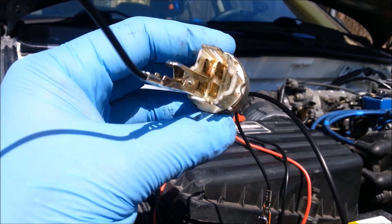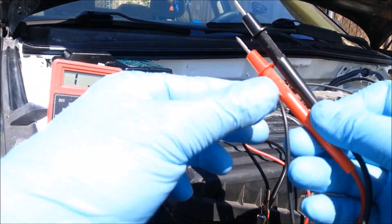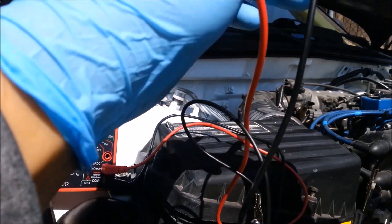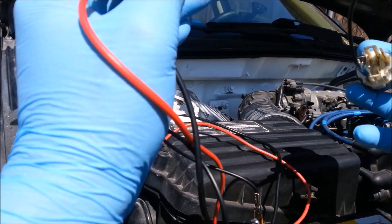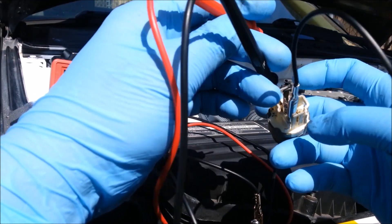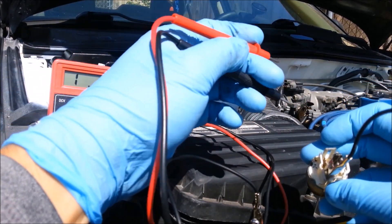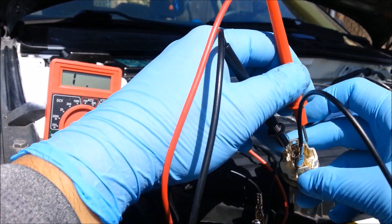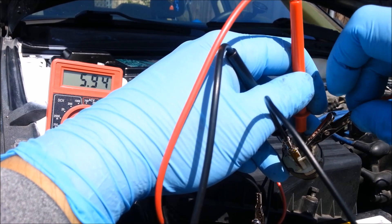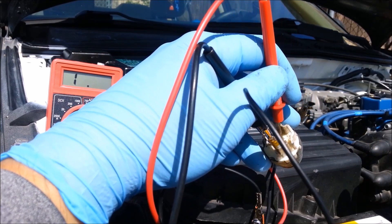It's working, but sometimes a click is not enough. Take your voltmeter, set it to ohms - make sure you have no resistance, just zeros. Take your leads, place one right there and the other one right here. You should have no resistance even when the positive terminal is touching number two. You see the number zero - this tells me this relay is good.